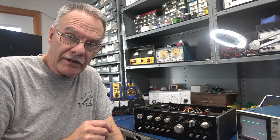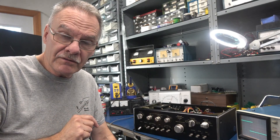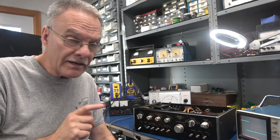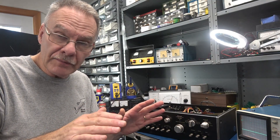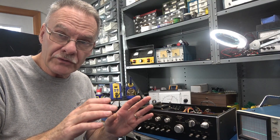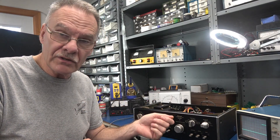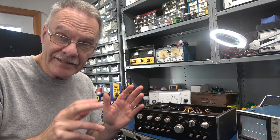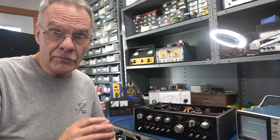Before I hook up a CD player, I just want to remind you guys how important it is to have an oscilloscope on your test bench. Without that scope, I never would have seen the clipped signal and the loss of amplitude. You can't do this by listening to a speaker or trying to catch it on a DC meter — you have to be able to see it. Good shops always have a scope on their audio bench.